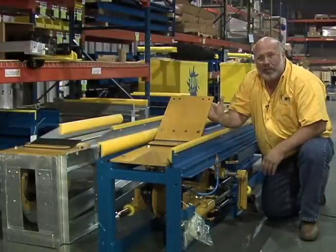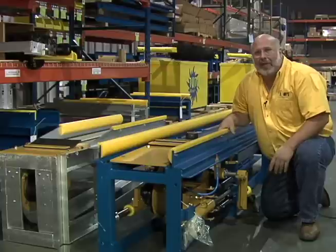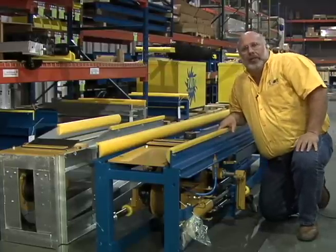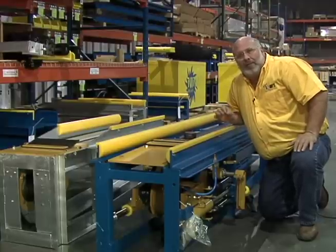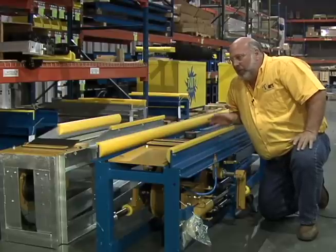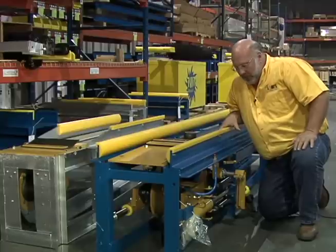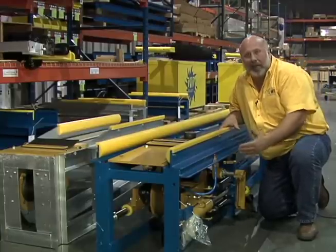The old way, we'd bring a fork from here trying to catch the roller — if we were too late, the pressure would push the fork down, the roller would get stuck on the end of the deck or twist into the conveyor. This eliminates that completely. We call this the anti-jamming roller-up system. The air take-up uses two air shocks that create air tension, allowing us to use the x-458 chain for ease of maintenance, or the sc78 chain designed exclusively for Sunny's — both are very reliable, bulletproof chains.